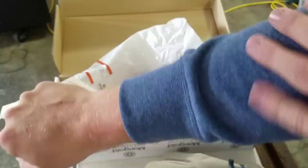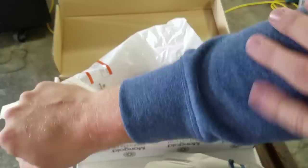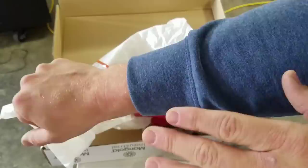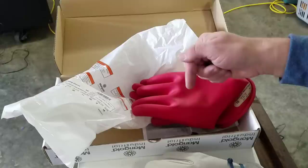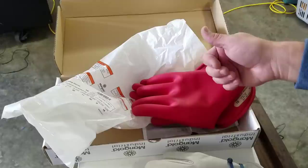Always, when you have your hand inside a TV or any other electronics that has power going into it, only work with one arm or hand at a time. Keep the other hand in your pocket — it's called the one-hand pocket rule. Just use your work hand and keep your other hand in your pocket, so you're never going to ground something through your chest area, which can really cause damage to your heart.